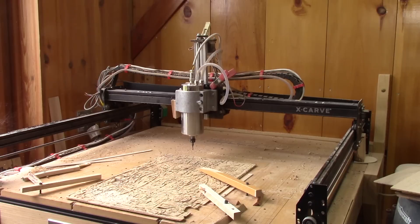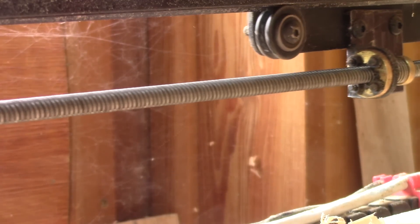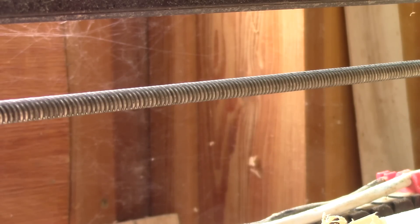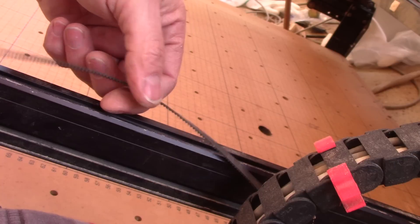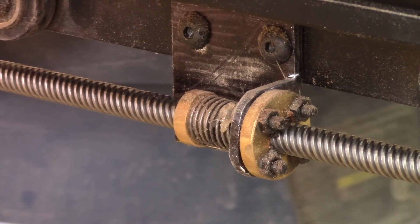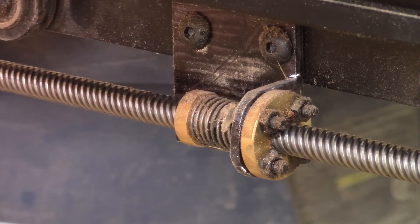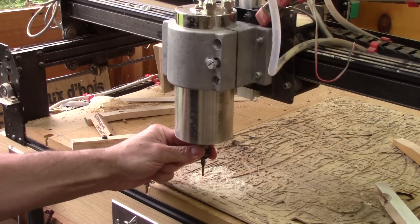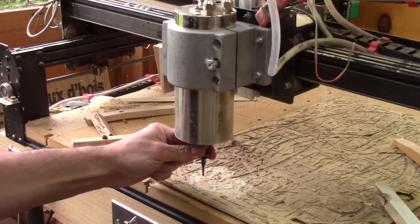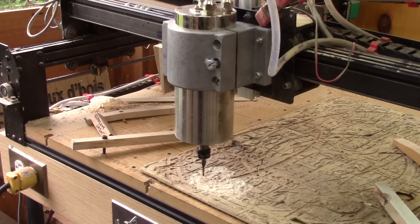Over the years, I made several modifications to my CNC to make it work better. But they didn't always improve it. Like when I put those lead screws — they're so small and long that at some point the machine starts to oscillate and even stops. To fix this, I had to put back the driving belts. They break at least twice a year, on top of not being precise. The worst part of this machine is its flexibility. It bends so much it's almost impossible to use for precision work. So I've decided to make a new CNC rather than try to make this one work.